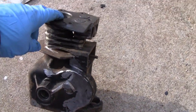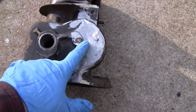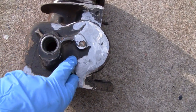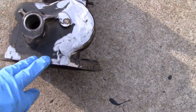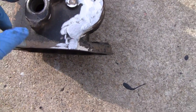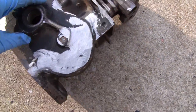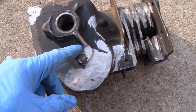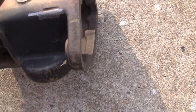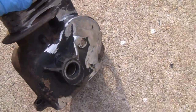Alright, I brought you out here so maybe you can see a little better. I ground all that stuff off — it came out pretty nice. I made a little loop around the cam — I gotta keep that, it holds our cam in place. I got rid of the little tabs down here, just for casting, and a fin up there. I left this one for a little bit of support. I ground off some of the little tabs on this thing, so it's pretty cleaned up. I'm pretty happy with it.